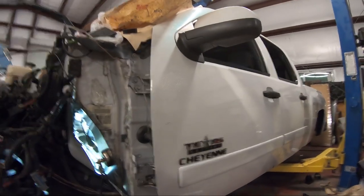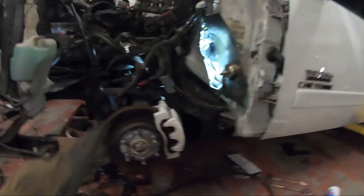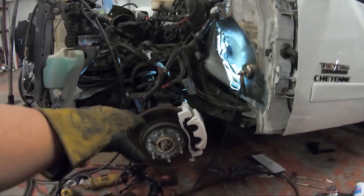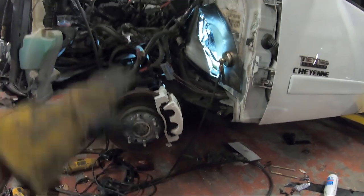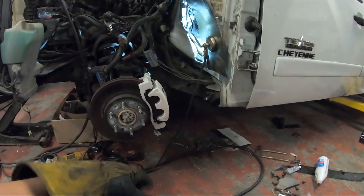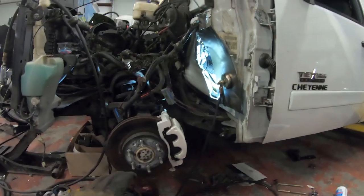This is a 2010 Silverado four door, and we are putting on the 26x9 with the 1-inch lip, which is these wheels right here. And the final drop that it's gonna have is gonna be 9 inches, which is gonna be the upper and lower control arms with the tuck and turn setting to it. It's gonna have the spindles and then the adjustable struts. And once it sits on the floor, it should be maybe three or four inches still above the frame off the ground. So drivability should still be okay. Hopefully it doesn't sit too low and then it's uncomfortable.